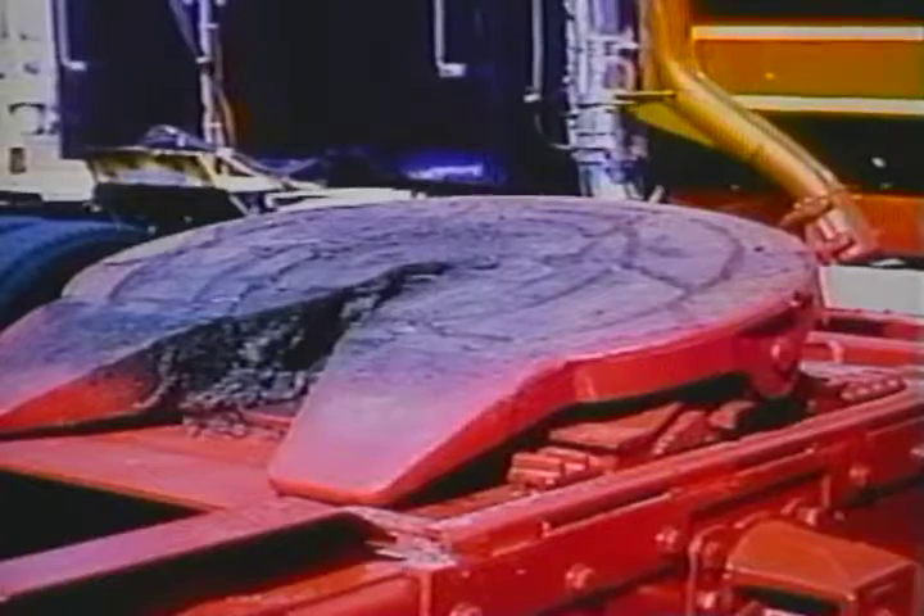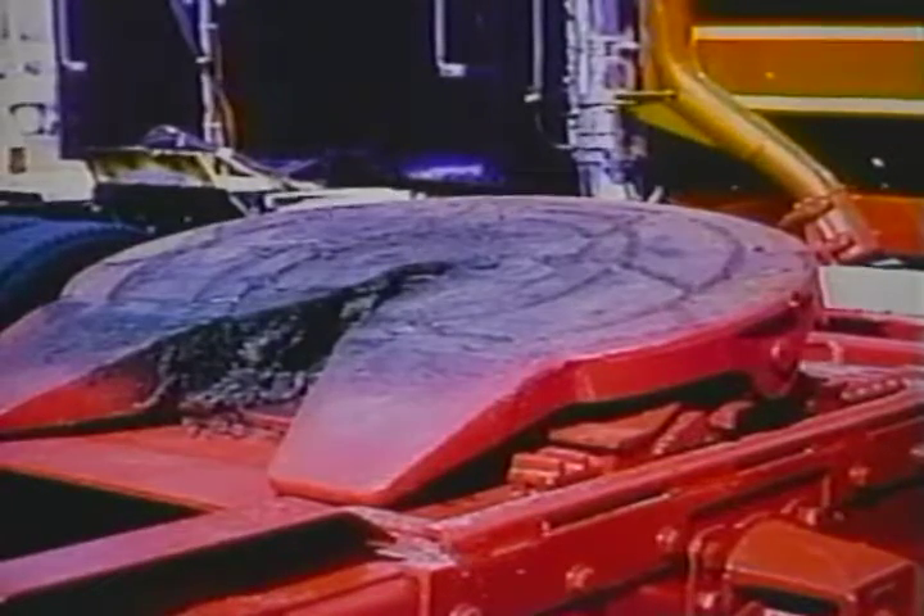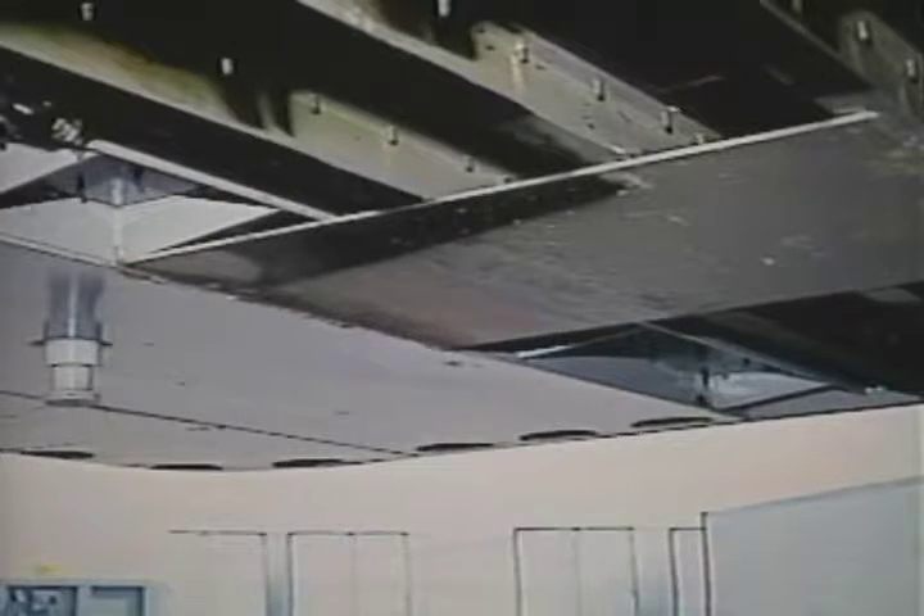The fifth wheel is the name given to the casting on the rear deck of the tractor, which accepts the kingpin and holds it securely as the trailer is pulled down the highway. The first component to be made is called the upper fifth wheel assembly, which incorporates the kingpin, a critical item which will connect the tractor to the trailer itself. Together, these assemblies must withstand the full weight of the trailer and its load. A fully loaded trailer may weigh upwards of 60,000 pounds, so a good margin of safety is provided to withstand the stress of high speeds and heavy usage.